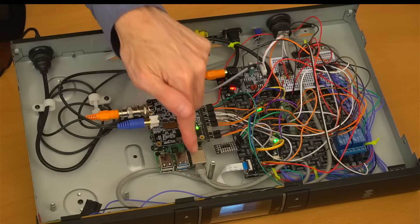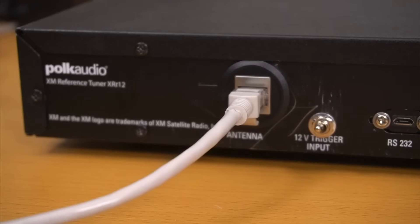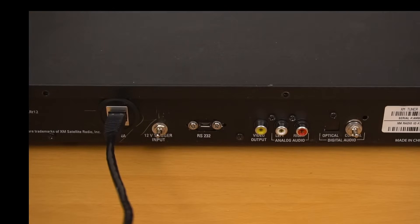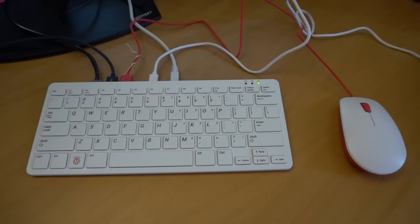I've also extended the Pi's Ethernet and power to the back of the unit, reusing some of the holes from the original tuner's jacks. The custom software on the Pico is written in CircuitPython, a programming language designed to simplify programming of microcontrollers. I extended the USB connection to the Pico out to the back of the unit. Throwing this toggle switch allows for editing the code on the Pico from an attached computer, such as my favorite Pi 400. This one is running all of my custom code in a Docker container.